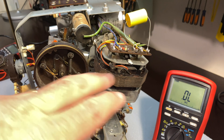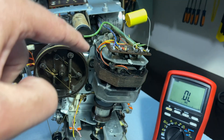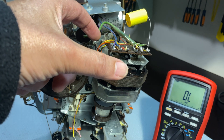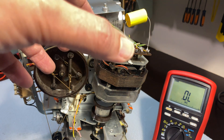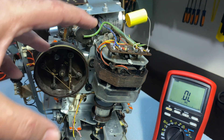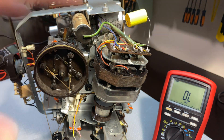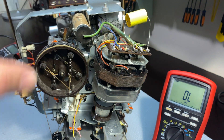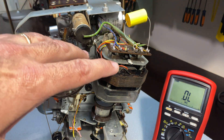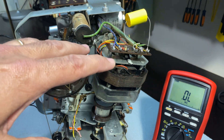Let me explain what happens here. There are four windings on here on these opposite corners. Two of them are controlled by the AC mains and the other two are controlled by the control circuitry. The idea is that depending on the phasing, this thing is made to rotate in a particular direction or the other. What is important right now is to understand that there are four windings.